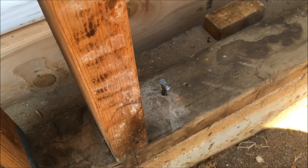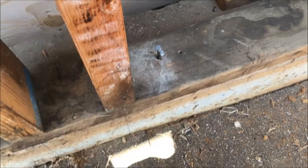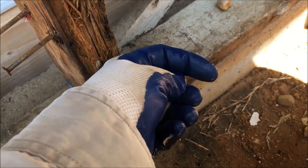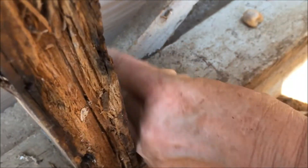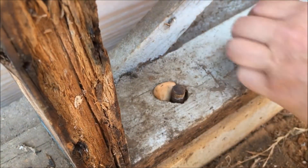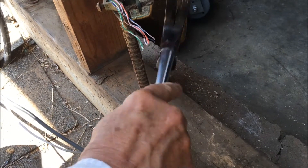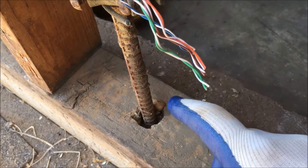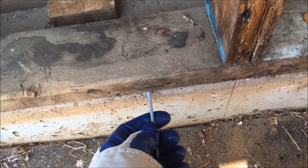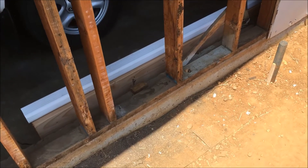That other nail came out of the siding — that's an electro-galvanized nail. These pins will stabilize the wall, the sill plate, and keep it from moving. We're going to take this rock and wedge it right in here so that it stops the sill plate from moving back out that way. Perfect — it's not going anywhere. Now we're going to do the same there, and we put a little rock right there to stop the sill plate from moving back out. You see how much we were able to move that sill plate over — that's pretty darn good, y'all. And that's how we moved our sill plate to prevent waves in our siding. Hope it helps and happy DIYing!